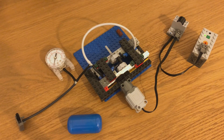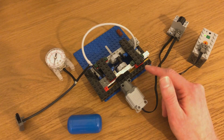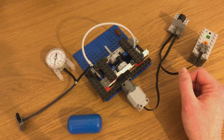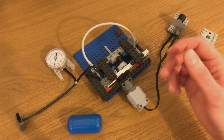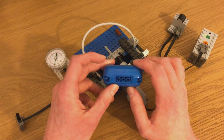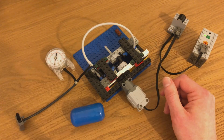This is one of the first things I've put together for the robot — the compressor for the pneumatic system, or at least a sort of test bed for it. It's quite fundamentally different to the compressor I have in my pneumatic flipper. With a flipper, you basically want to release and transfer loads of energy at once, so you have a bunch of air tanks to store a larger volume of air at high pressure.